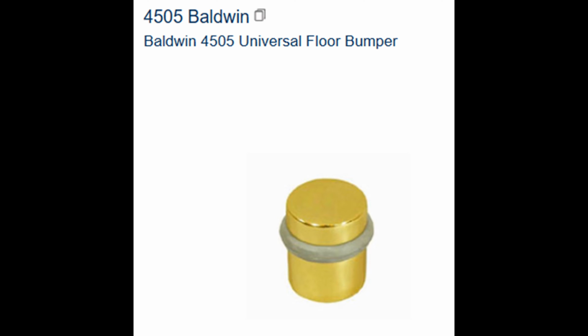Any heavy-duty application, whether it be a mall or a hotel or an airport, they're going to have overhead stops, because there is no way to stop a door properly by using a floor stop or a wall stop or a hinge pin stop or a baseboard stop, any of that stuff. If you've got high enough traffic, you'll just crush any door stop. So you have the proper slide track hardware, and they call them overhead stops. Glynn-Johnson is the name most synonymous. If you looked up the part number 104S, you'll see it or its ilk.